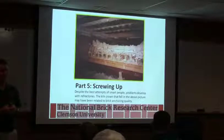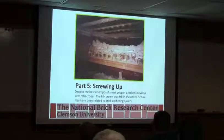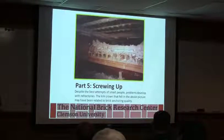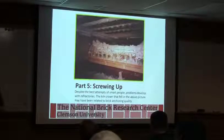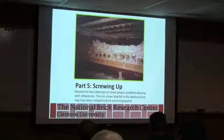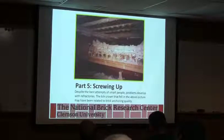And the big thing, I can't stress enough, that I always look at, because I've seen problems in my experience, is expansion. There are so many instances that I've witnessed where expansion was not taken into account, and how many problems. It usually doesn't scream at you the first one, or I'm thinking more periodic kilns, the one or 5 runs in, but when you get 10, 12, 20 runs in, that's when you usually have little pieces start coming off the corners, and things start moving that shouldn't move.